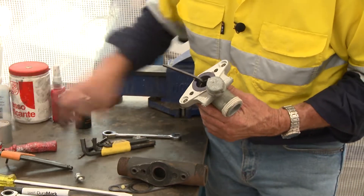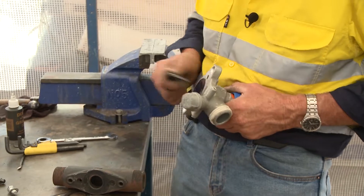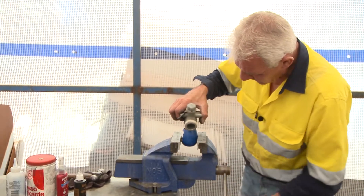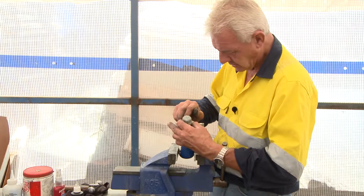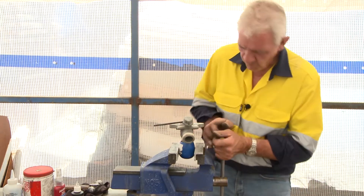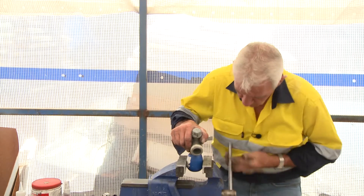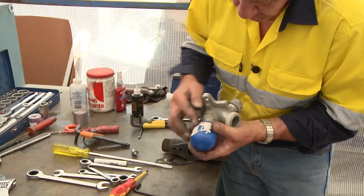In this case they're metric. You hang on to the Allen key and turn the knob. If it's a bit tight and you need to use a vice, make sure you have soft jaws on the vice or you can actually bust the plastic on the knob. On site, you can also put a pair of Stillsons on that knob and undo it - just gently increase the pressure. Keep turning the Allen key until the knob remains in the same position, giving you the opportunity to get the Allen key undone. With the Allen key winding out quite easily, release it from the vice - and as you can see, the knob hasn't been damaged whatsoever.